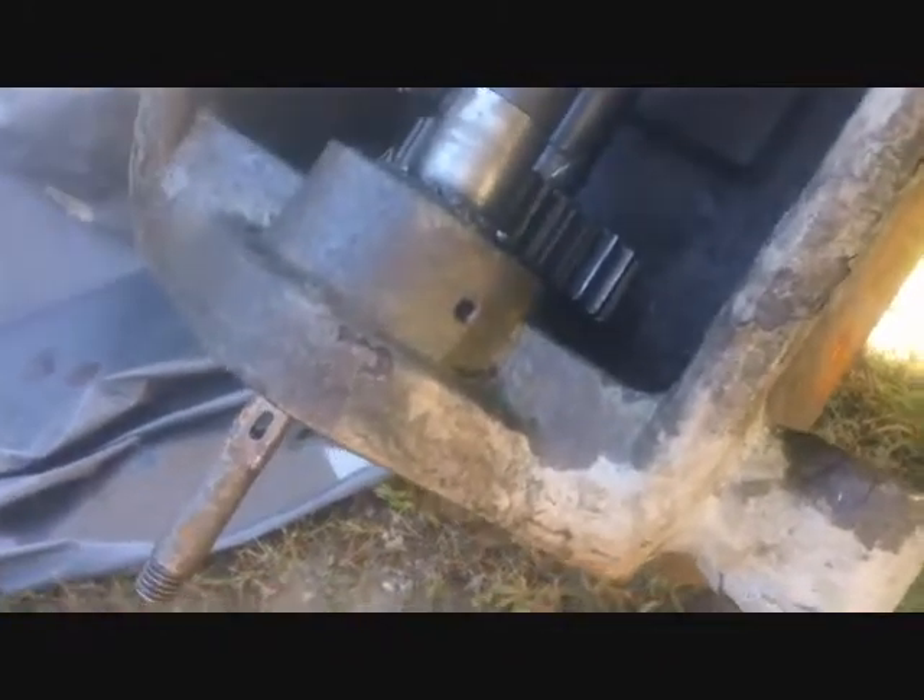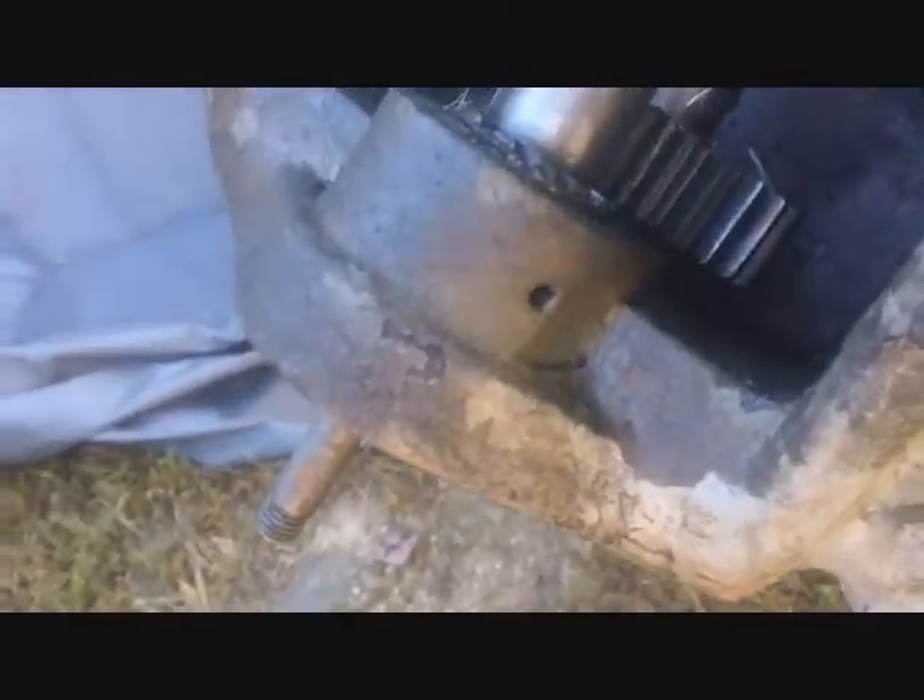I can't imagine it's a pin — it wouldn't be a pin going through because there's no hole on the opposite side. It's a blind hole, and also this shaft actually needs to rotate, so you can't have a pin going through it. I still think this has something to do with retaining this end assembly and keeping this shaft in, so I'm going to try drilling these out. As long as I don't go too deep, I might damage the outer gear, but I'd like to save the shaft because somebody might need it.